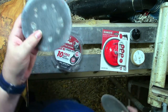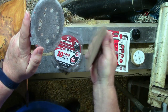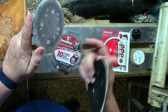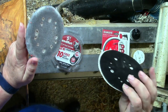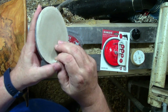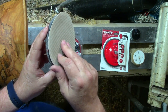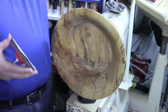Take your pad and take the velcro insert — and by the way, I advise that you put sandpaper on the piece you're getting ready to assemble just so you don't use the wrong side. Put spray adhesive, something like 3M 77, on this side, wait a few minutes, put them together, and now you have a mandrel that you can use velcro-back sandpaper on. Instead of a little 2 inch disc, let's just look at this bowl.